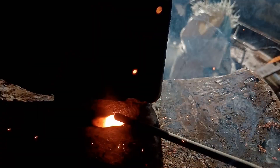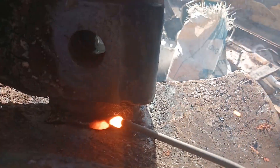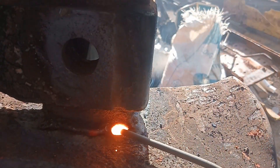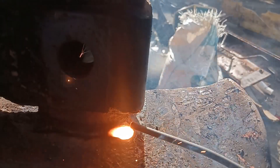Watch carefully. The welder is keeping the arc steady, maintaining proper angle and travel speed. At 130 amps, too much dwell time can overheat the bolt, while too little heat won't fuse properly. But with correct technique, this setting creates a solid, long-lasting weld.